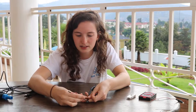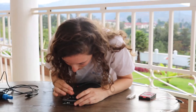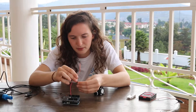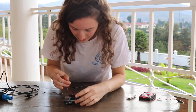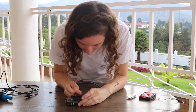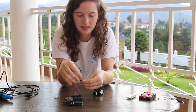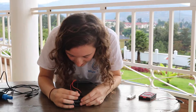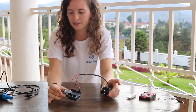We start with the red wire and match that up with the red wire there — that goes into the five volt terminal on the data logging shield. We then get our yellow wire — this is orange because all of our yellow wires broke — and we plug this into terminal two on the other side of the Arduino. We then take the black wire, which is our ground wire, and plug this into one of the two ground ports on the Arduino. And now that's wired up.